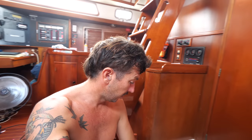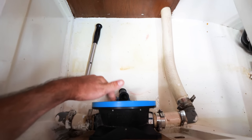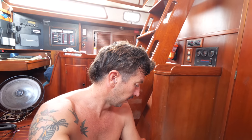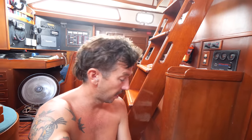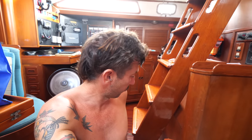Underneath the couch here you can see it's just so much wasted space. There is a poorly installed manual bilge pump — there's another manual bilge in the cockpit, and this one here goes to the forward compartment underneath the fuel tanks. I still want to keep this manual bilge because it's good to have, but we want to take the water away from the battery compartment. So one of the first jobs I need to do in preparation is to move this. I'll change it so it routes underneath the generator into the man cave, with the manual bilge access in the man cave.